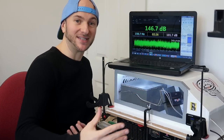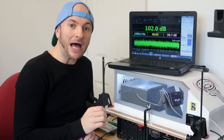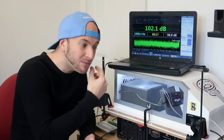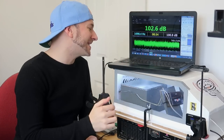It's not monstrously louder, it's not 4 dBs louder than the other enclosures, but it definitely is a step above. Now the interesting point will be whether this can maintain those high dBs at the higher frequencies. So let's do the 33 scaled hertz next, which is a 198. When I tested this on the bench, I wasn't originally planning to go all the way up to 15 watts because the driver started reaching mechanical limits even with only about 5 watts. But since we put it in the cabin here, there's enough cabin loading that it seems, by my ear anyway, to be loading the cone enough to get us up to about the 15 watt mark. So I'm just going to go for 15 watts, and if the driver rips itself apart, then so be it. So let's see, can it maintain?